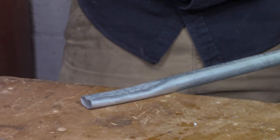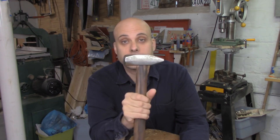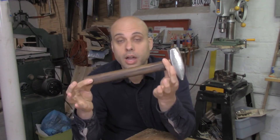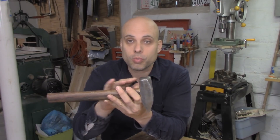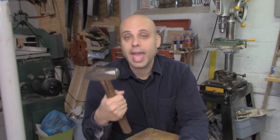I've been able to work on a lot of different techniques with nothing but this conduit. You also really need a decent hammer, but up until recently I did all of my smithing with this inexpensive cross-peen hammer. This is a Craftsman hammerhead — I bought it used at a flea market for $2. I put on a thick untapered handle made out of white oak, and one of the more experienced smiths showed me how to dress the face so it was nice and round and smooth. I used this thing exclusively for four or five months and it's fine, especially when you're just starting out. Grab something like this and get going.